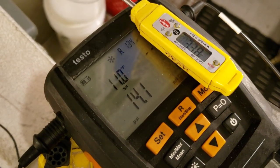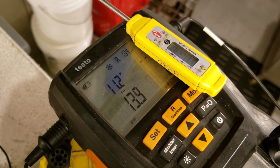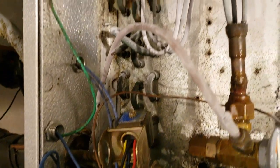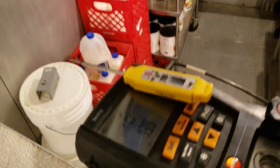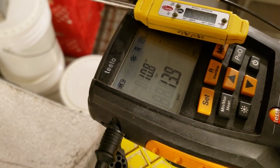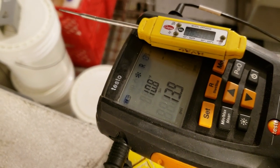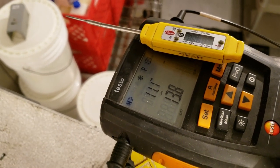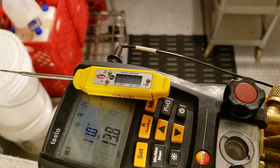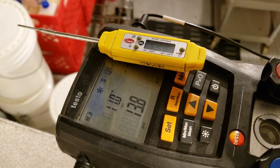It's 33 in here. I have 11 degrees superheat — it was 10 earlier. Somewhere between 8 and 10 is the norm. Because it can act unpredictably and change on you, I'm going to stop there. It's obviously gotten down to temperature — we're going to call this thing a day. There was 10 again. Before I cause it to go wacky, I was moving in super small increments and waiting a while. I've noticed you cannot rush it — if you go jumping too quick, you'll put that valve into a frenzy and it will take forever to settle back down.